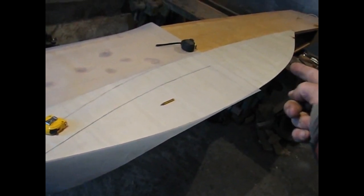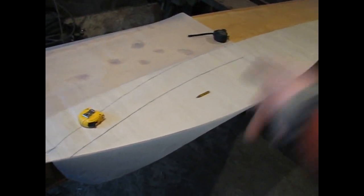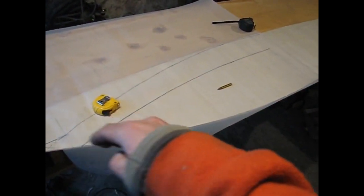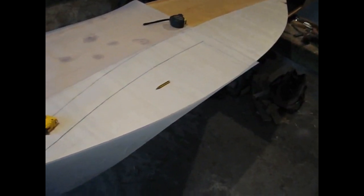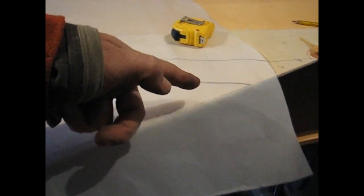Now I need the other side of the lee pod. That's really difficult to do with battens. I can make a template, but it's much easier to just take this clear paper and copy the line. I trace out the shape of the hull, put it on my centerline, then flip it over and do my best to get a perfect one. Here's the paper flipped over — that's the line. I go over it with my pencil and the bottom pencil line will transfer onto the plywood. No carbon paper needed.